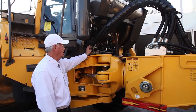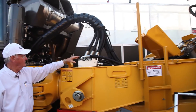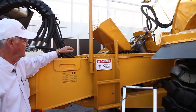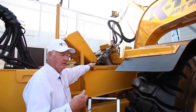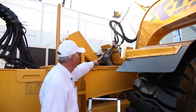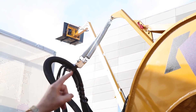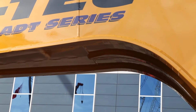Hydraulic power from the truck comes from the pump first and comes out right here with pressure and return lines. Following these hoses down to the K-TEC valve, which transfers the fluid whichever way we want it to go. It follows hoses down here, and we have a double filtration system to take care of any foreign material coming from the truck so it won't contaminate the scraper. From there it goes up the hoses to the accumulator mounted on top, then comes straight back down to a junction point where the hydraulic oil is distributed to all the different cylinders.